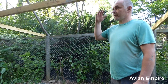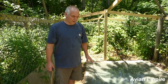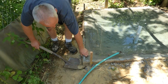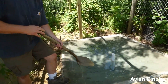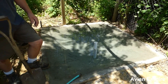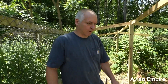We'll have this in operation as soon as we get the top netting on this particular aviary. This is just an unused space between a couple of aviaries and we decided to put a couple of ponds in. We're all complete with this concrete pond built over the past couple of days. The only things left are to pop this frame off — they generally pop fairly easy, sometimes you need a pickaxe or can unscrew the frame — and then to cut the drain overflow pipe off so it keeps a proper water level in the pond. As you can see, we scraped the concrete up to the top of the frames, and that gives us a level pond line all around. Hope you enjoyed the video.